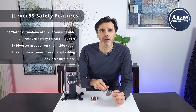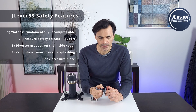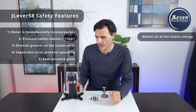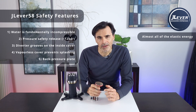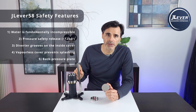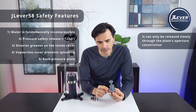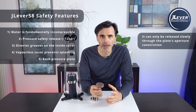Number five: the back pressure plates. Apart from the benefits discussed in the previous video, these also double up as a safety device. All of the elastic energy stored in the unit is stored in the chamber, and if the basket fails with the back pressure plate in place, only the energy stored in the actual basket can get instantaneously released. All that energy in the chamber will be prevented from releasing through the back pressure plate. We'll do testing to see how that behavior works.